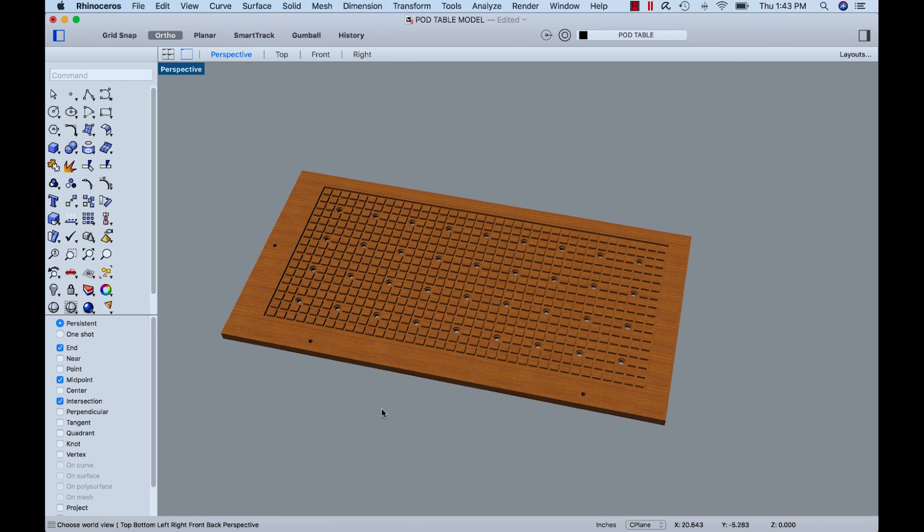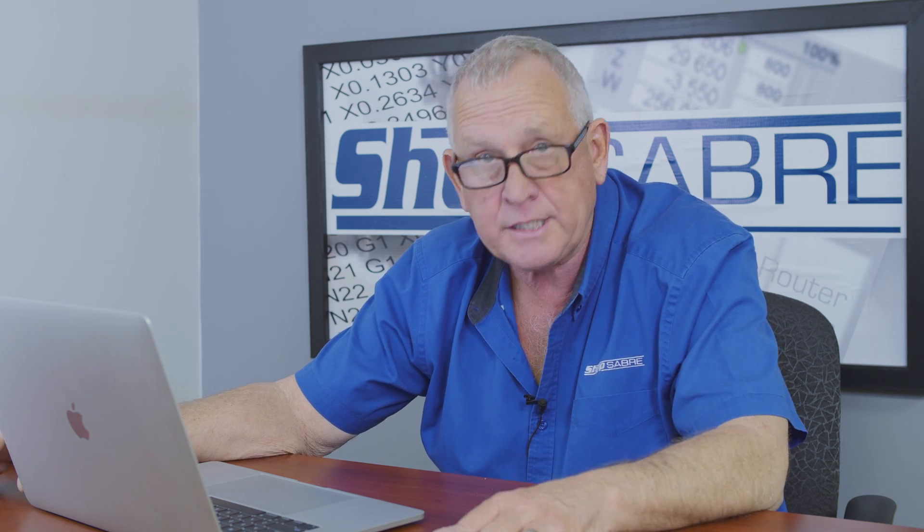What you see on screen here is a 3D model of this concept. The material is Baltic birch — I selected that because the quality is good, there's not many voids in it, and one inch is a nice thickness. It stays flat. You'll see some holes here — those are for the part locator pins. My machine has part locator pins, so I can raise those pins up and drop the board down on them and always know where it is. That's part of the quick changeover — I can grab this, put it on the table lined up with those pins, and I know it lines up.